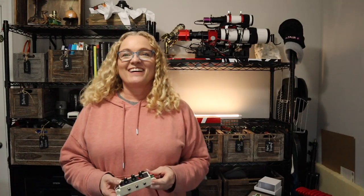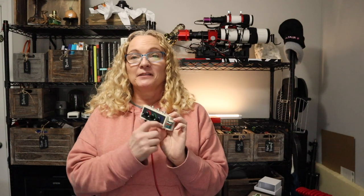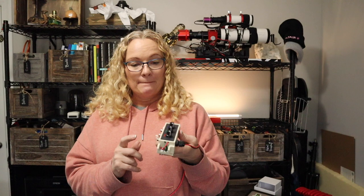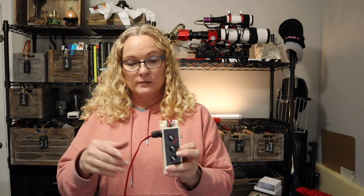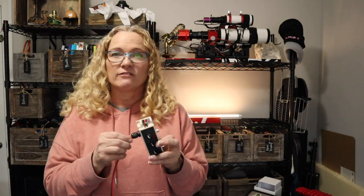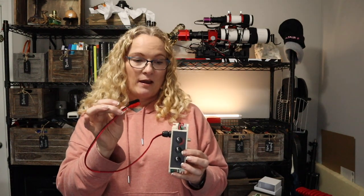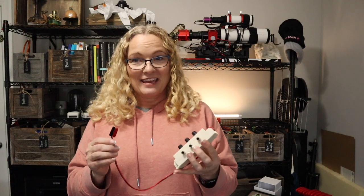So we did it! I just made my first dew heater controller. I'm really excited about this — it's a nice little small profile. I can label it up when I decide where I'm going to put everything. It works. I made one goof where I had crossed up my power. In hindsight, I should have drilled all my holes first. I've got a cable gland here — the power goes inside and then out up here to be wired, and this is to keep any cable strain going. It's not a perfect fit — it's a little bit big for this particular cable — so I'm going to put a drop of silicone in there just to seal this box up. I completed it with my favorite Anderson Power Pole and it works. I checked all three dew channels — I could turn them up to whatever I wanted. I don't know what temperature I'm turning them up to; this is going to be trial and error. But I did it myself and I'm really proud of myself.